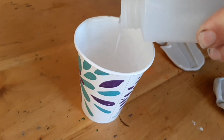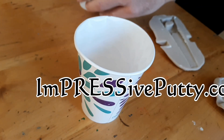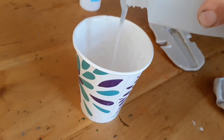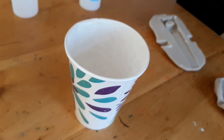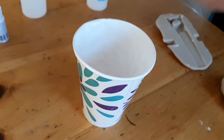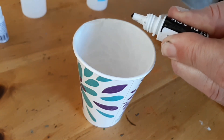Now we're ready for the casting. The soft bait rubber is our material for making soft bait fishing lures, but it's also a great silicone rubber for very flexible castings. It mixes one part to one part, and I added a little bit of white and a tiny drop of black to make a grayish color. The rubber by itself is a slightly transparent, original non-color.